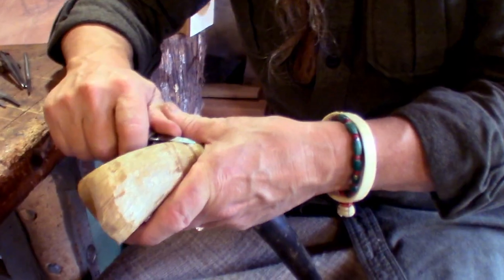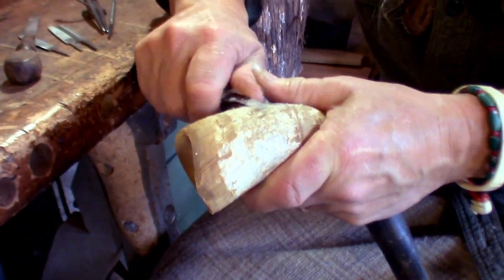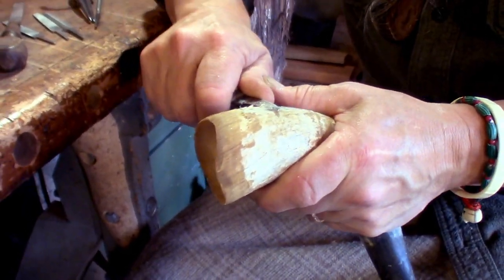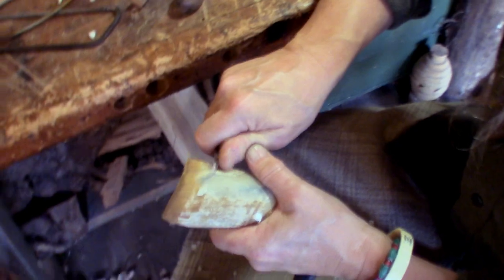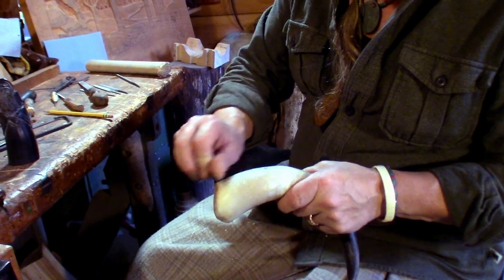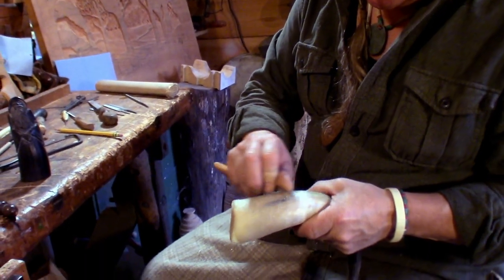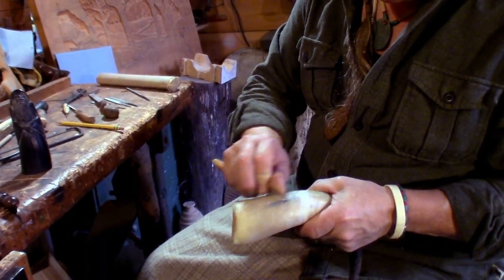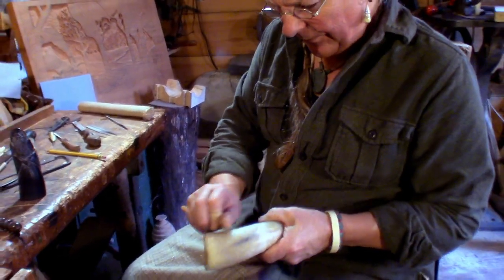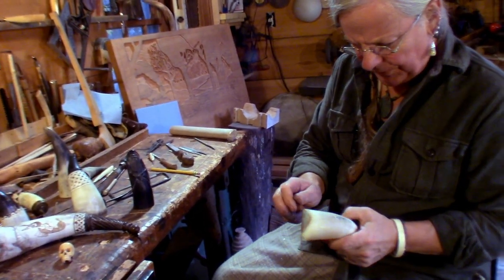Nice sharp knife, and gently, not to cut too deeply first. You don't want to muff it up right off the bat. Carve this down. It doesn't take a lot if your knife is sharp. Scrape it now with the blade like this, which helps to planish it down a little bit closer. But sometimes in doing that, the blade chatters and you start getting like a washboard effect on it. That's not desirable, as washboard grooves tend to go fairly deep.